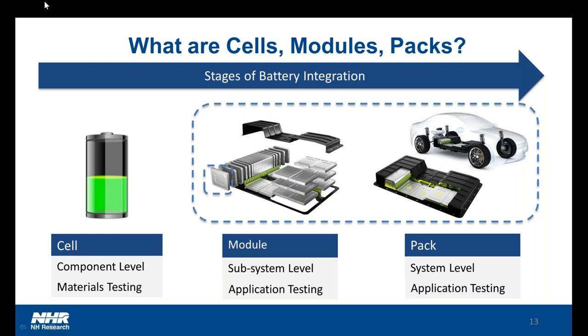If you were to carefully take apart a 9-volt battery, you would see that inside are actually multiple cells — either three, four, or six individual battery cells packed into that can — and that can also provides the connector and makes it easier to plug in. So a 9-volt battery is an example of a module. It could also be described as a pack, which is a construction of any number of modules, including one, wrapped with an outer housing, electronics, and packaging to make it usable in a specific end application. While we talk about cell going into a module going into a pack, there are fundamental differences in what types of testing would be done at each level.